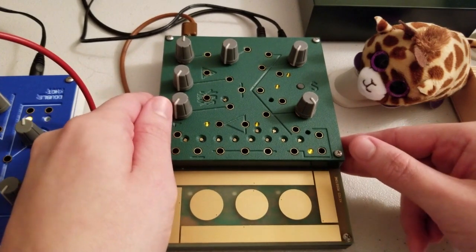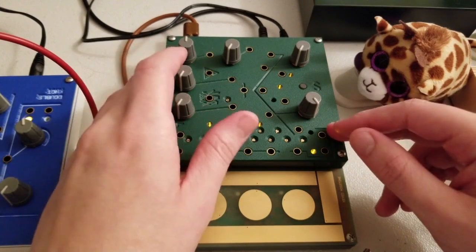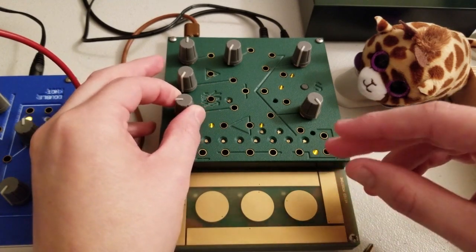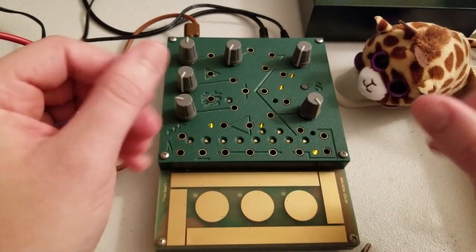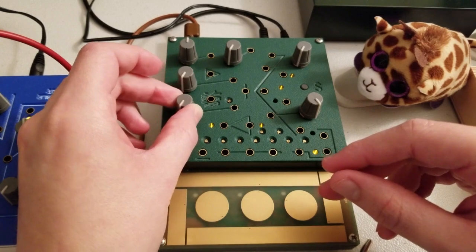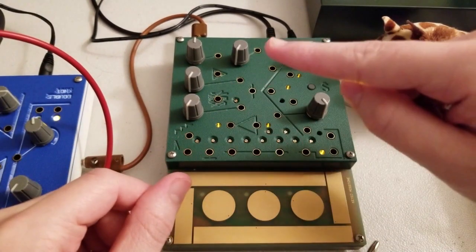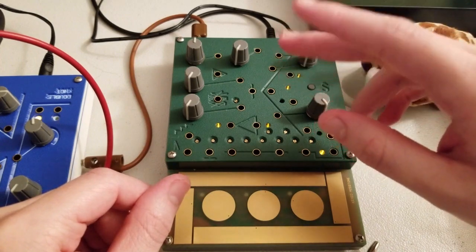Essentially, the interesting thing about this is that the noise and the triangle wave get mixed before the wave folder. So once it's getting wave folded, it ends up affecting both together as sort of a united oscillator. What that means in practice is, if you look at this under an oscilloscope, whenever the triangle is in the middle, it's pure triangle. And then as it gets to the tip, noise starts to color it.